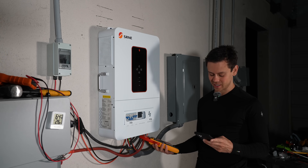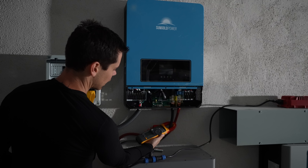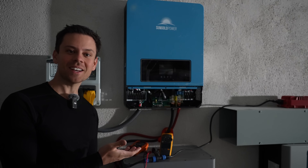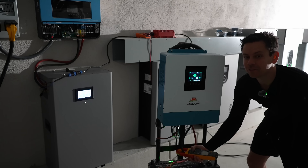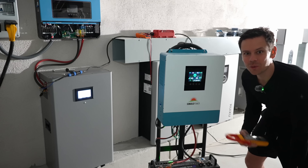That's like a Voltronic. Let's test the other SRNE inverters. This one's pulling 1.7 to 1.8 amps at 53 volts, but this is a 10,000 watt inverter so that's pretty typical. This other one is at 53.2 volts pulling one amp for a 5,000 watt inverter - again, that's typical.